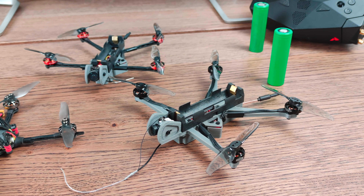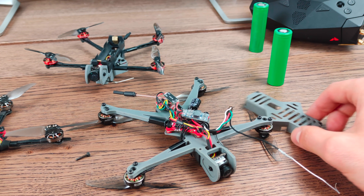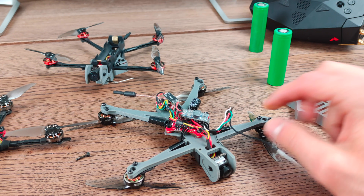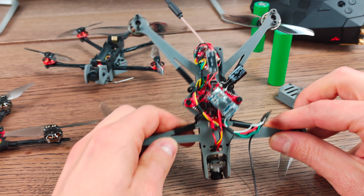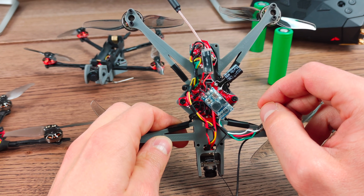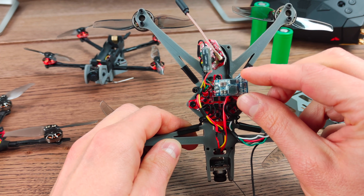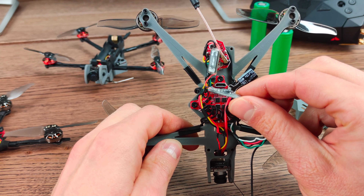This is an issue since the 5 V circuit on the flight controller isn't designed to go down to 2.5 V input. It will tend to collapse at around 3 V, and your camera and/or VTX will start to shut down. But the good news is it's actually quite easy to avoid that issue. If we take off the little cover and look at the electronics inside, we do have an extra component you would not typically find on any 1S toothpick — this is a step-up converter, which converts the input voltage of the battery to 5 V.